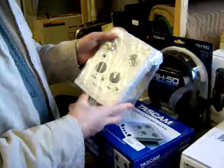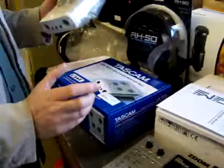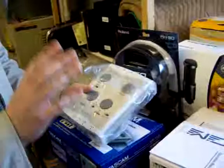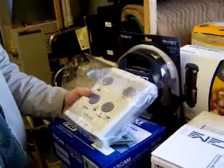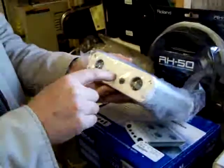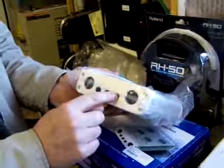I have more experience with this one here, which is a wonderful unit. These run $229. Obviously if customers have more money to spend, I think the best one is the Roland BR-900 CD, or they have an upgrade that runs about $1,300. If somebody wants to get into recording on their computer relatively cheaply, this is great. You can plug two inputs in it. This middle one is for the headphones. You can put two XLR mics in here at the same time, or you can put an XLR mic and a line input like a guitar directly in there.